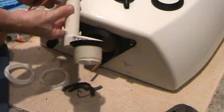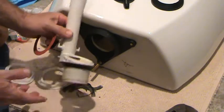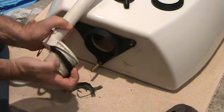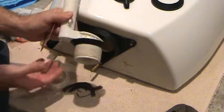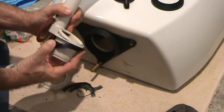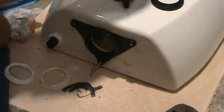See, that pipe is connected to this here, and that is what's in the toilet tank. It's got a new gasket on here — I put that on there, but the old gasket was leaking. So in order to get this tight, I put the new gasket on like that. The small side, tapered side facing down so it fits into the slot.